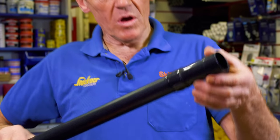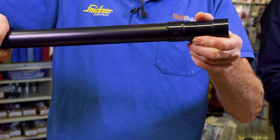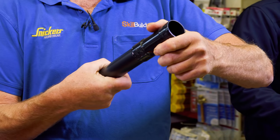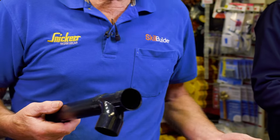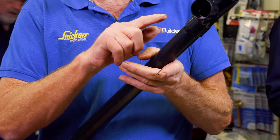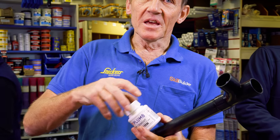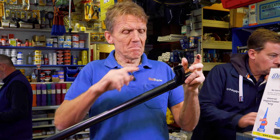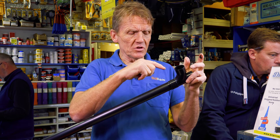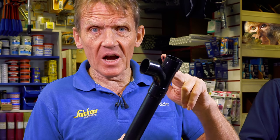When you join them together you've got a limited time before the cement goes off, especially if it's hot. I've used a bit too much here. Then you give it a twist around — that's important, because if you don't twist it there could be a dry spot on that pipe that hasn't bonded. But it will stick — absolutely 100%. As the name suggests, it's not actually a glue; it's a solvent weld cement. It's melting the two surfaces — the fitting and the pipe — together and welding them. When it's stuck, it's stuck.